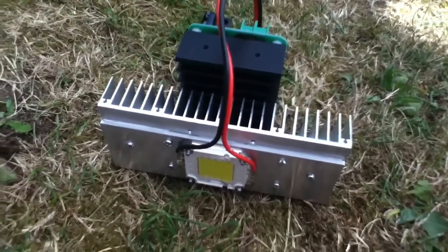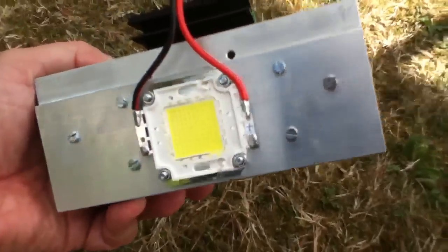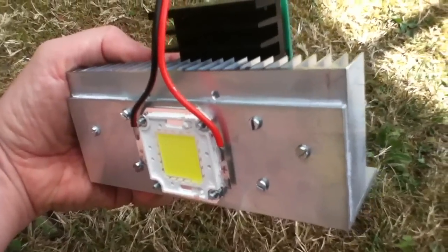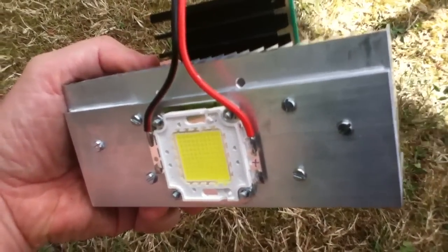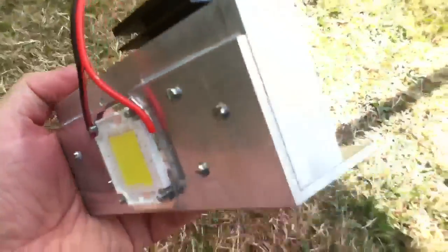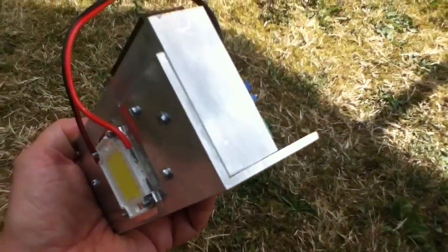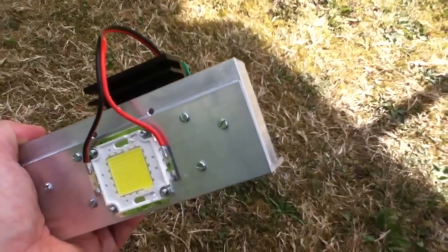I've been doing some modification of my 100 watt LED hardware. I've put the main heat sink for the LED directly flat on the back of the front face of the aluminium, because all the heat from the LED needs to pass through the aluminium quickly to get into the heat sink block so that it can radiate away from the fins. Originally I had the heat sink under the bottom section, but it meant the heat from the LED was having to go round an L-shaped corner, which is a bit like putting a waterfall through a letterbox.